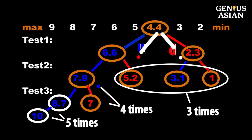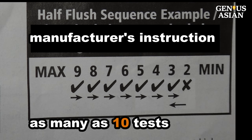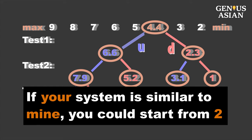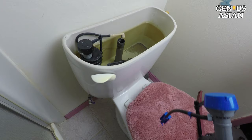So with the optimal golden section ratio 0.618 search, you may perform flush tests wasting water no more than five times. These are the paths for three tests, and these are the paths for four tests. But if you follow the manufacturer's instructions, the worst case could be as many as 10 tests. This optimization is best if you don't know anything about the underlying system. If you do know something, you can use that knowledge to your advantage — for example, if your system is similar to mine, you could start from 2. We spend time on the dial adjustment because if each person flushes six times daily, that is 2,000 times a year per person.